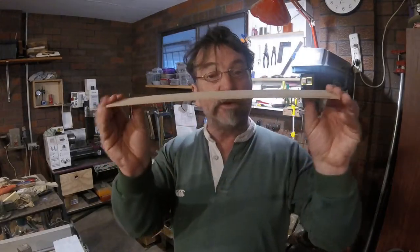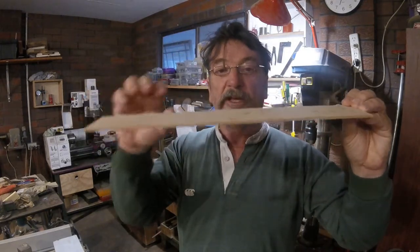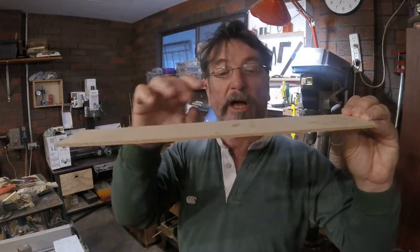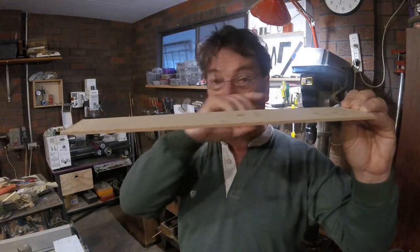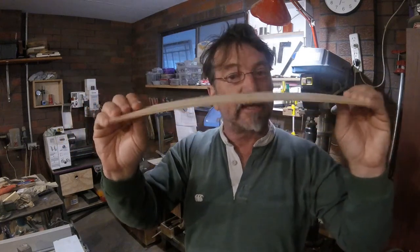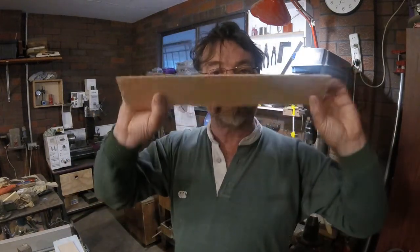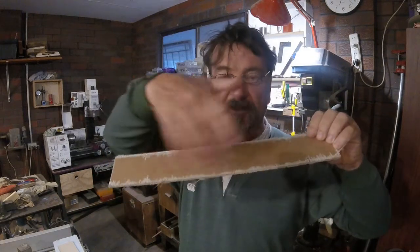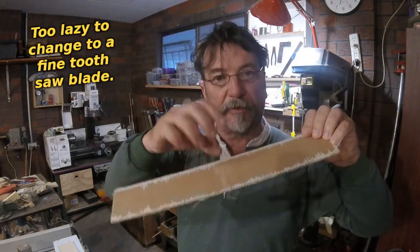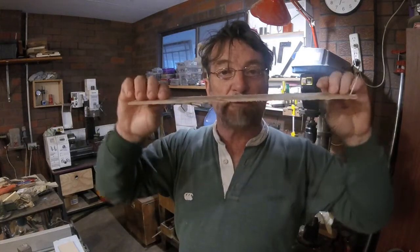We're building this Blowfish boat out of three millimeter MDF, and as you can see, three millimeters isn't very much. It's going to have a laminate of fiberglass on both sides — 250 gram woven cloth on both sides with epoxy — and I expect that to add quite some structure to it. To test how much it adds, I've done a load test on this piece of scrap. I plan to put the pair of them between two fulcrums and load them to see what deflection you get.